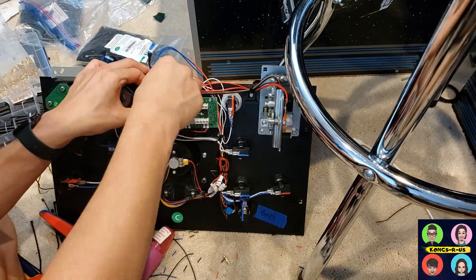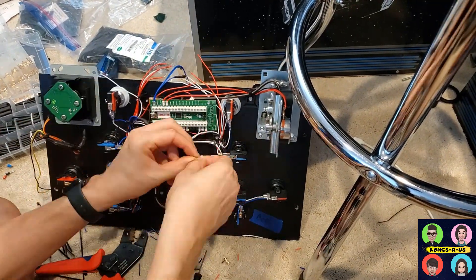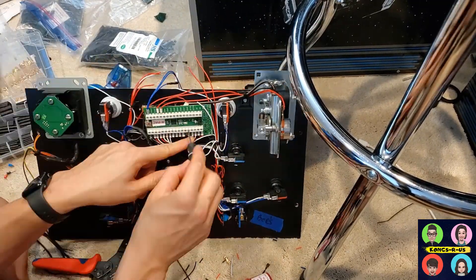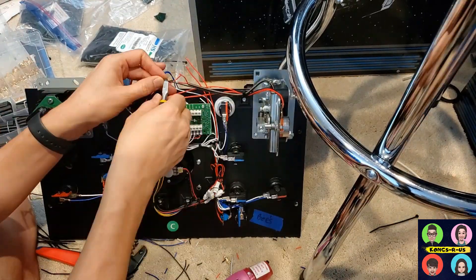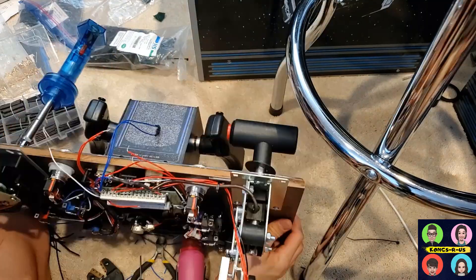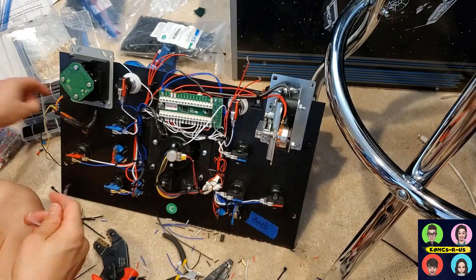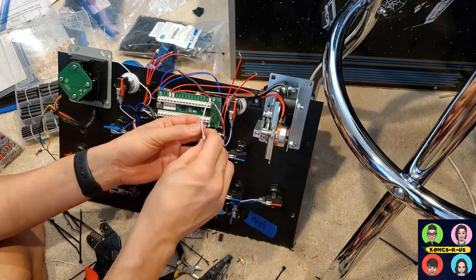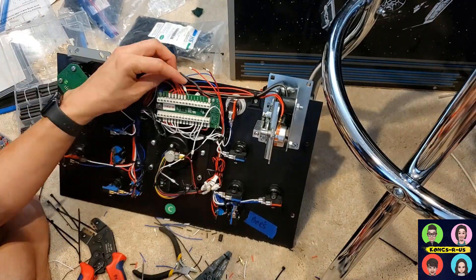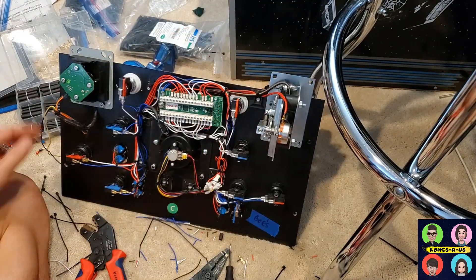Another thing I did here was get my volume buttons working with my original switch mod. I cut the wires and plugged the brown as the ground wire, with red and black as left and right, then mapped that to an arcade button on the APAC — specifically the player one number 12, 11, 1A, and 1B side. Using a program like JoyToKey, I map that arcade button so the switch moves volume up and down. That's another thing you can do with these mods — a nice little upgrade. Here's what my finished premium mod looks like.